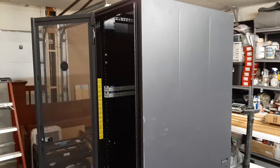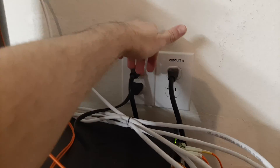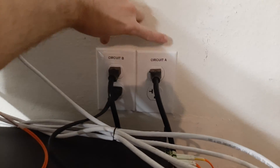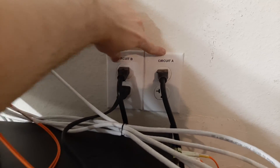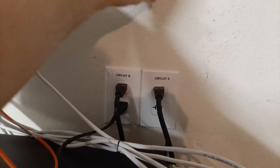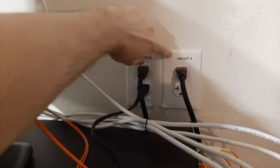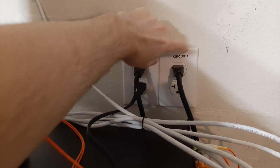I'm going to be doing some electrical work also, so I'll definitely clue you guys into the electrical work. When I ran these two circuits here, it was kind of a temporary thing and I knew it. One of these is going to actually be a 30 amp circuit, and the wire that's ran down here is 10 gauge — the orange Romex — so it is actually good to go for a 30 amp circuit.